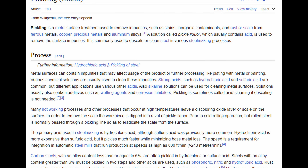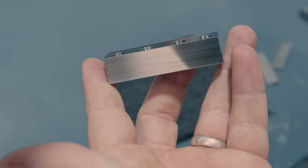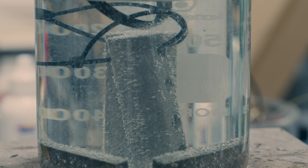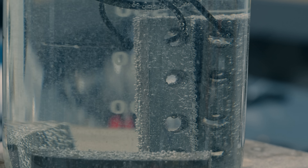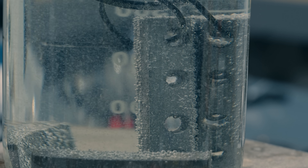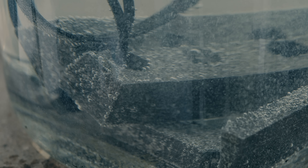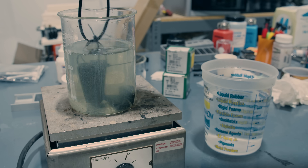A pickling step with acid is sometimes recommended to remove oxidation, but since these are freshly milled, there's no real oxidation or rust, so I skipped that step. Next, they are immersed in hot parkerizing solution. This is basically phosphoric acid with dissolved manganese, and probably some other proprietary ingredients. The hot phosphoric acid reacts with the iron in the steel and generates hydrogen gas, which we can see here as bubbles. This reaction increases the pH of the solution right next to the metal and causes the manganese to precipitate out as manganese phosphate. Some of the iron also reacts to form iron phosphate and deposits at the same time. These phosphates cover the surface of the metal until all free surface iron has been reacted, and then the coating process stops.